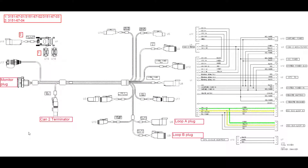We are going to follow the CAN signal through the Apollo system the way it's used on the Virgo tank, starting at the front at the monitor plug. The monitor plug is here and is also U1 on the drawing. There are two sets of yellow and green lines coming out. We're going to be focusing on CAN 1. The other set is CAN 2 — it goes out through the harness, turns around and comes back, and is terminated at CAN 2. So we only need to focus on CAN 1.